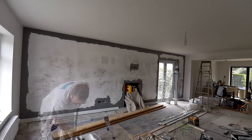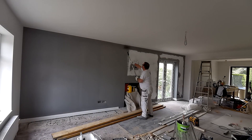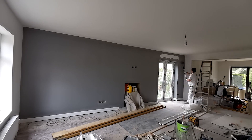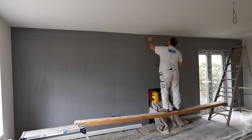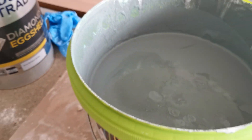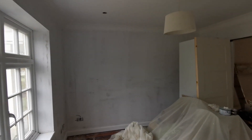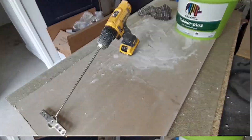This room we've done on day work, as you can probably tell by the way the walls have been rubbed down. Knocked that out in Farrow & Ball Plummet, which was a bit of a nightmare to cut in as you can imagine. But with Indeko from Paint Shack — if you've not tried it, give it a go. It goes on the wall like cream, and the good thing is you can juice it down quite a lot, so a little goes a long way.